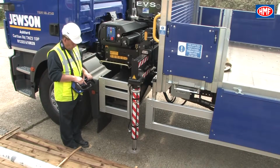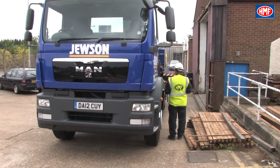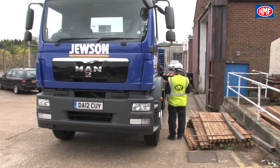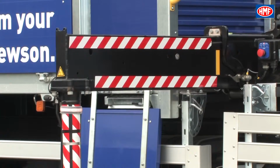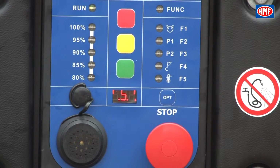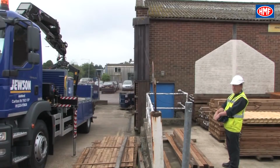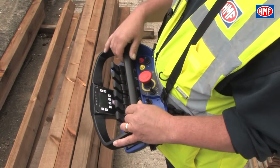When setting the stabilizer leg, always try to level the vehicle as much as possible without raising the wheels of the vehicle off the ground, with the assistance of the spirit levels on each side of the crane. When each stabilizer leg is deployed, an extended tone is emitted from the RCL system to indicate the stabilizer is in contact with the ground, and the leg shown in the RCL display will stop flashing. At this point, the crane is ready to be calibrated for crane mode.